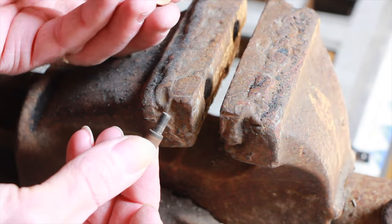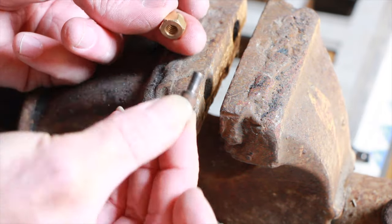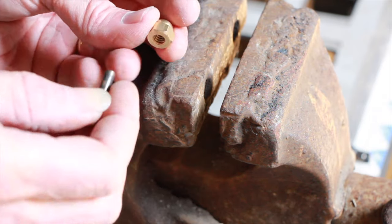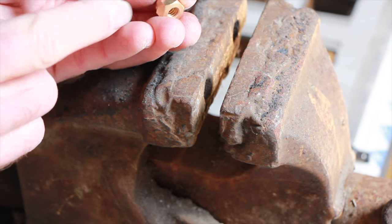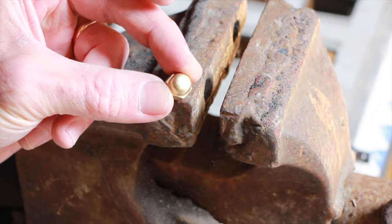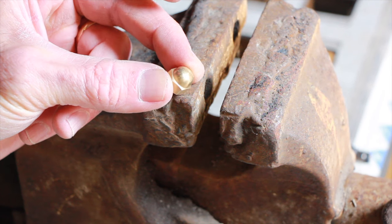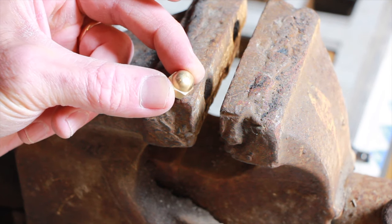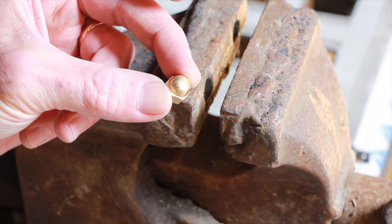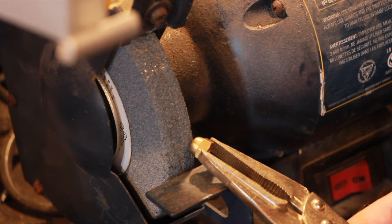You can see that with this half-inch acorn nut the threads are about the right diameter — this can fit in nicely. I just need to leave about five millimeters of the hex end. Since we're using brass here, I just want to remind you that anything other than naval brass can have a lead content of up to two percent, so you want to wear proper PPE — at the very least eye protection and respiratory protection. You can use a bench grinder or an angle grinder.